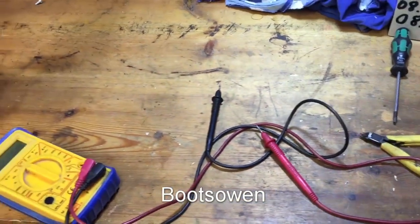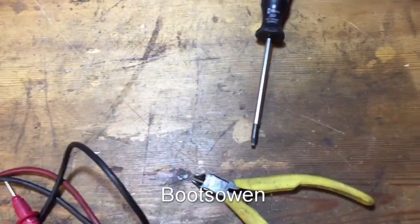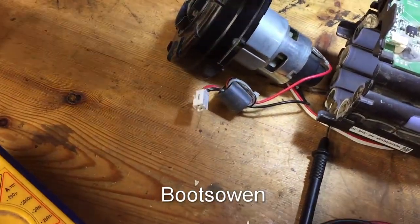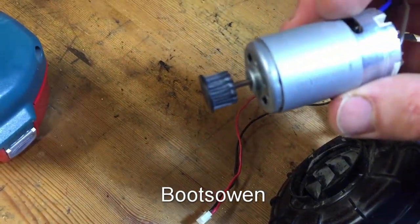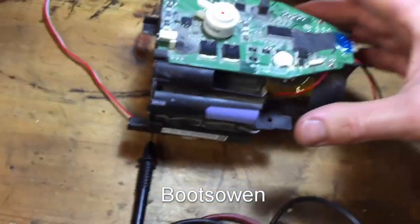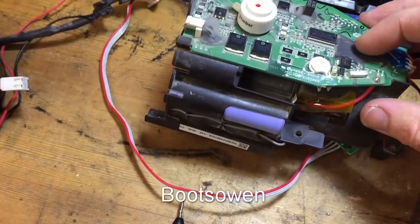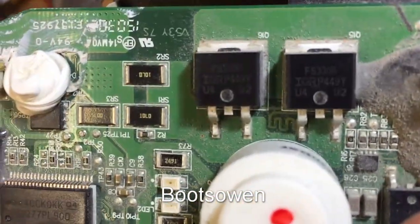In the meantime I've been playing with electronics and batteries. This little rig is the internals from a Bosch handheld vacuum - I've taken the casing off; it was missing its dust caddy. That's the motor from the brush bar - DC 24 volt. That's the motor and sucker vacuum unit, quite small and discreet. This is the battery pack and I thought this might be good for other projects. There's your charging port but it needs 30 volts to charge and I haven't got a charger that puts out 30 volts.